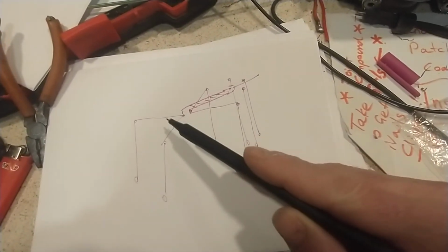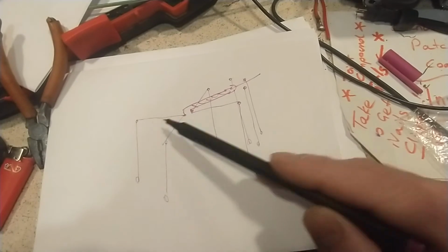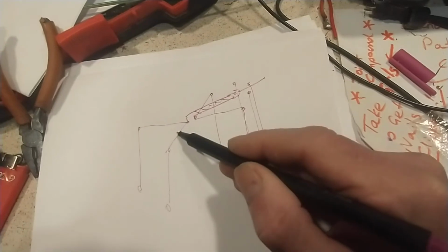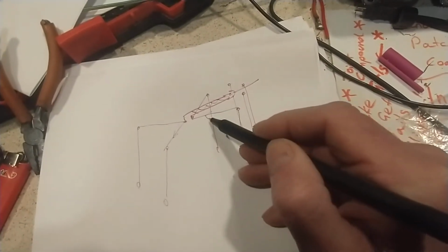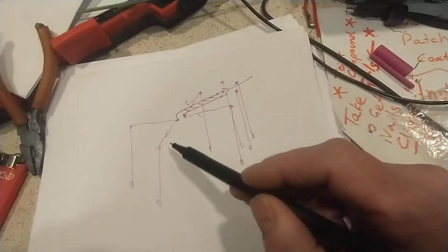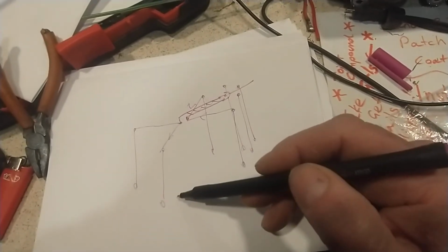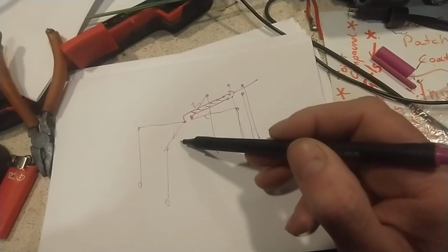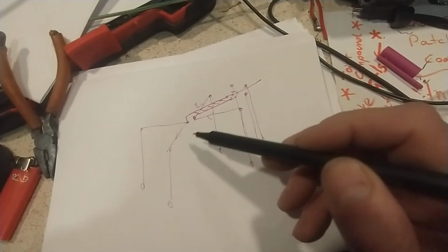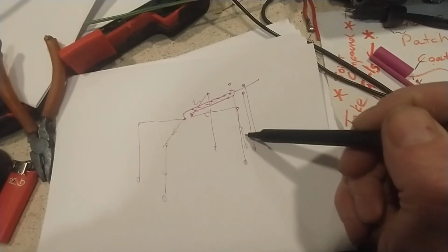So of course this side is one phase and this side is the other phase. Let's say when current is being driven on this side, it's being taken in on this side, and just like with a dipole, we would have coherence, currents running this way, then currents running this way. But because of the right angle, when currents are running this way, so being, let's say, positive on here and negative on here, we have downward on here and upward on here.